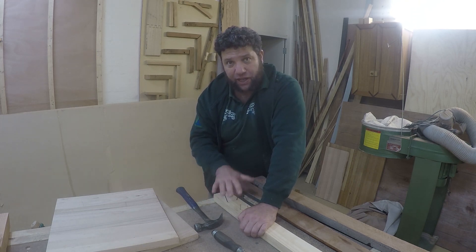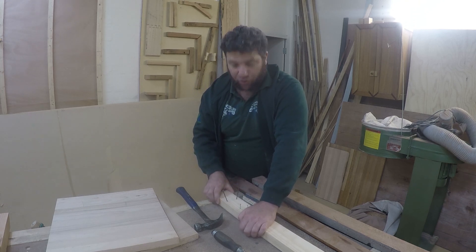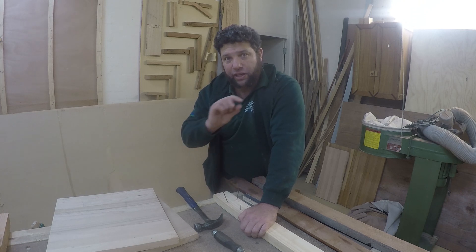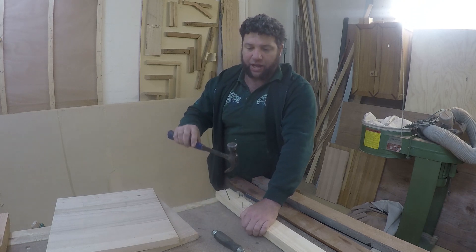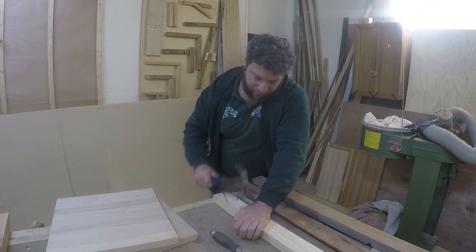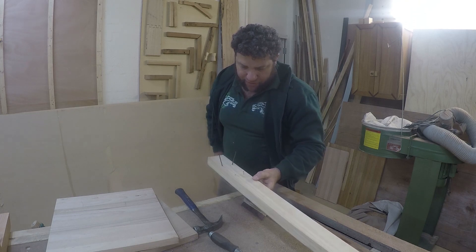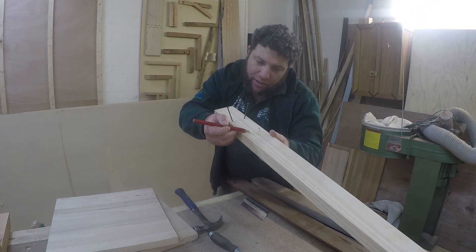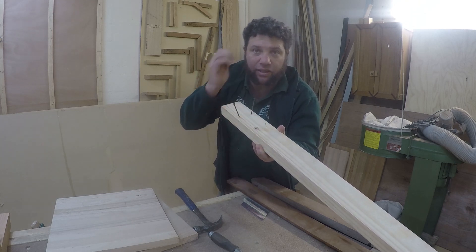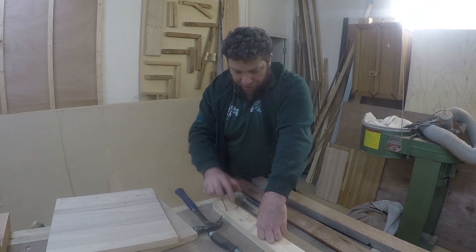A nail works by friction, which means that it can be pulled out by friction. If somebody's walking up and down on a floor and the nail is driven straight down, what's going to happen is, as the floorboard moves — even just a tiny bit — those nails can move just that little bit each time. So eventually you're walking and you can actually feel the tops of the nails under your feet. Another thing to look at is the rounded nose on the hammer. These have a very slight rounded nose. As we're nailing it down, you'll see there's a small little indent just here. What that indent does is it pushes the nail head slightly flat, pushed down and slightly underneath the surface, so that when I sand it I don't hit that nail.